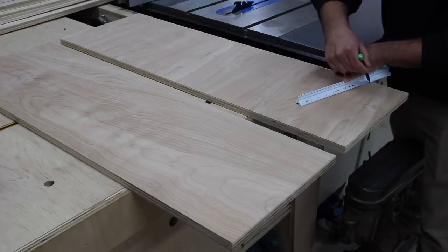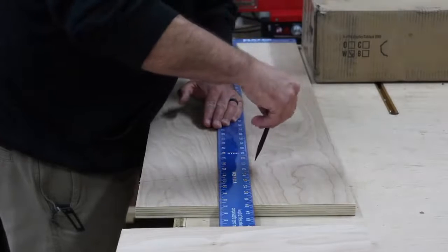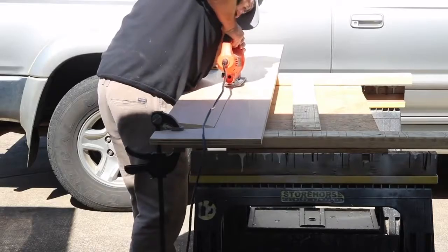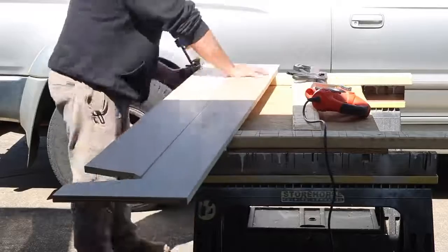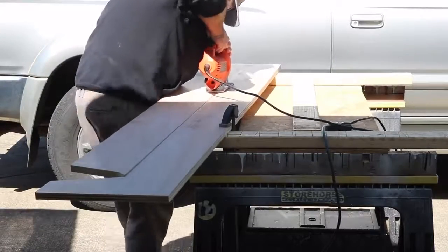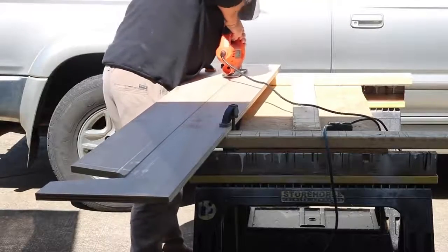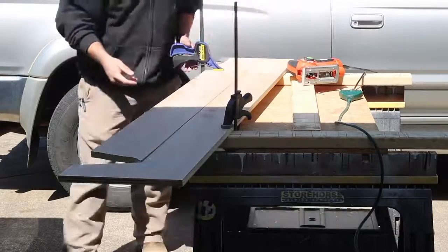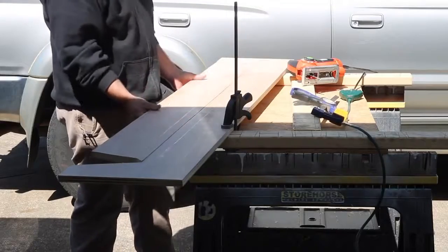The first thing I do is just break down all the plywood, and then I'm going to add some design elements into this bed — making all of this out of plywood. I'm going to be adding in some angled legs and cut out all of these sides and ends with a jigsaw to give me my leg profile. One thing I learned through this whole process was that I needed to just trust the jigsaw and let it do the work. I tried to rush a couple of cuts and my blade started wandering.